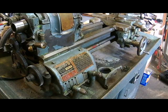The compound and cross slide are all tiny little castings — it'll be simple for me to deal with myself. I'm going to do like an automotive grade finish on this. I'm going to use automotive quality paints — some kind of activated epoxy paint or activated urethane so it's hardened and can take the abuse of hot chips without melting. That old oil-based paint was good but as soon as something hot landed on it you'd get a divot mark.